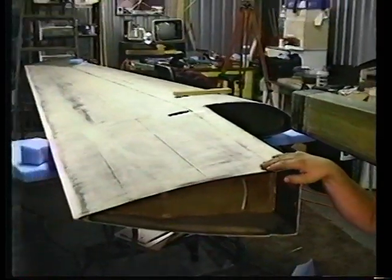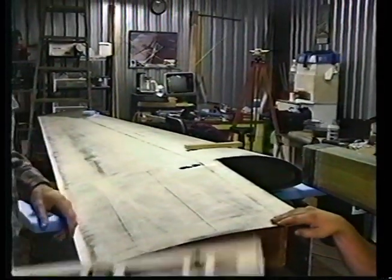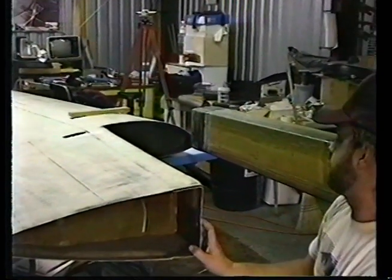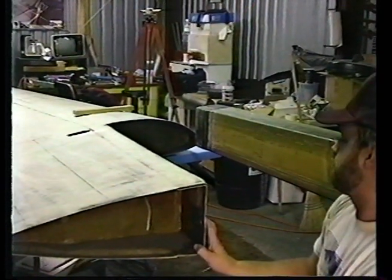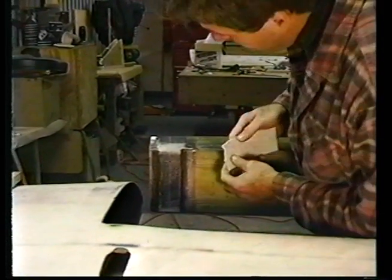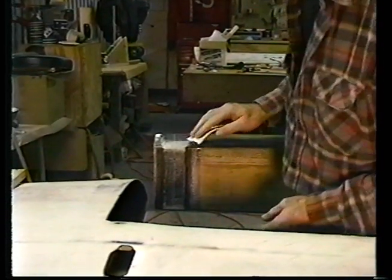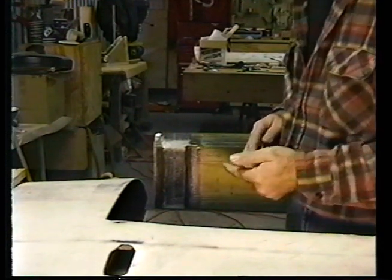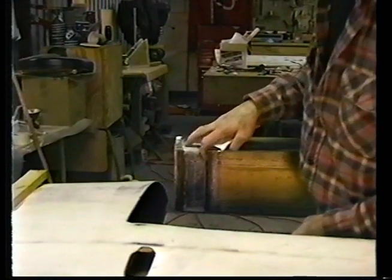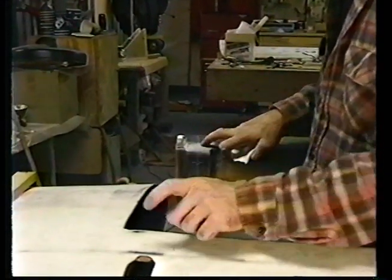We'll put the same reference board on the opposing wing and do all the transfer marks that you see right here. And then we'll put the wings against the backside of the spar, clamp it in place, and drill for all she's worth. I know you think Bondo is pretty versatile stuff, and so is flox. So what we're going to do is mix some dry flox with Bondo before we add any catalyst to get a more structural bond between this surface and this surface.